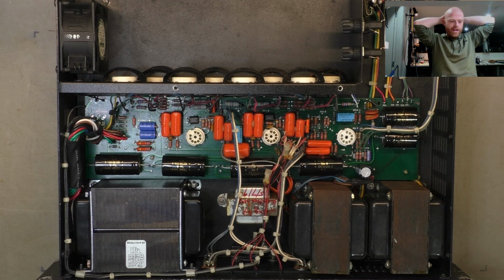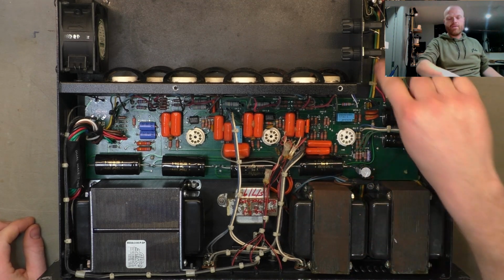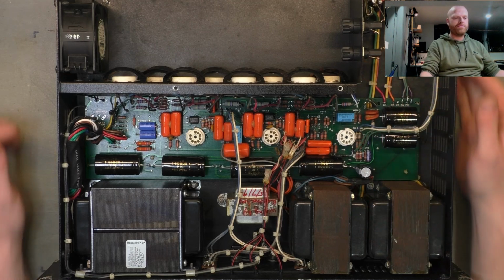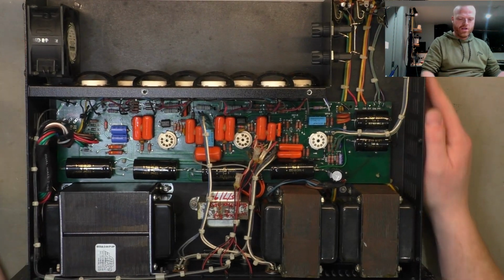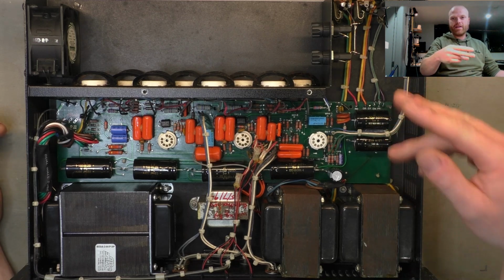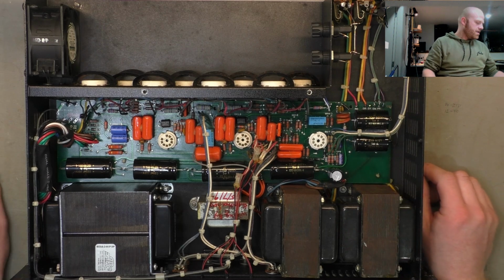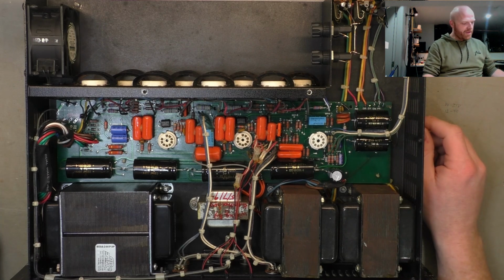Every single wire had to be either trimmed or re-terminated. Some wiring had to be replaced because that weird corrosion had just made it so the solder wouldn't take to the ends no matter how much you snip back, and none of these wires have a lot of slack in them, so a few of them had to be replaced.